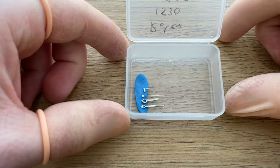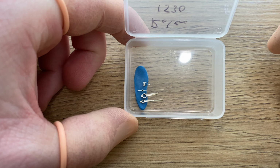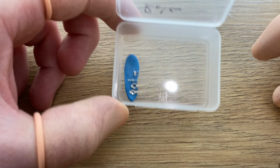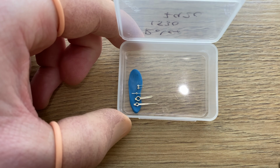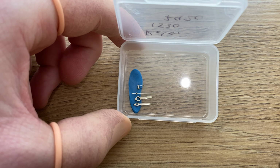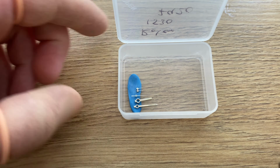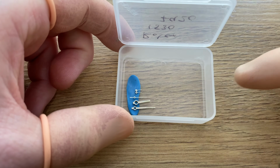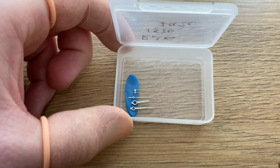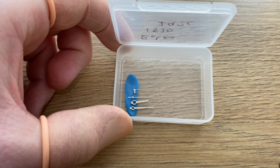Another important thing to remember is the correct storage of the hands. Here we have vintage chronograph hands, and we can see that I've actually put them in Rodico. If we shake the box, there's no movement, the hands aren't getting marked or damaged in any way. If they're painted hands, just be careful. We wouldn't want to put them upside down on the Rodico with the paint facing the Rodico, because that could rip off any paint and actually devalue the watch. So pivot or post side down, you could say, into the Rodico, and that's the safest way to keep the hands instead of a plastic bag where they're hitting each other.